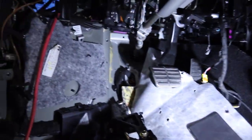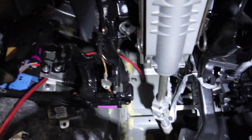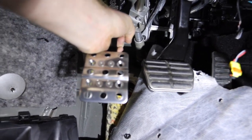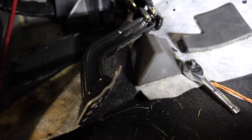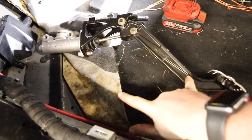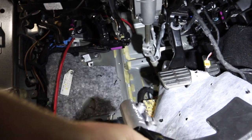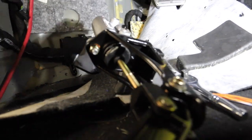So we seem to be getting just a little bit lucky. We already measured all this stuff out to make sure it was possible, but not until after we bought the car — so yeah, a little bit lucky. If we thread it right through between this thing and the steering shaft and come up here, we do have enough room for this thing to operate. You can see how this is out a little bit more than the brake, and that is okay — I'm totally fine with that. It's going to sit out a little bit more than the brake, but at normal operation you're not using the brake and the clutch with the same foot. We measured our articulation — the swing of this arm to be able to fully compress the master cylinder. We need about six, six and a half inches, and where we're seeing it, it looks like we have about eight. So now this needs to stand off from the wall pretty far, so we're going to work on building a spacer to space this thing off the wall. We'll have to build an extension to the threads right here, and then we should be able to start getting it installed.